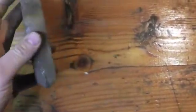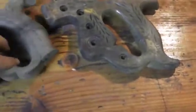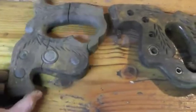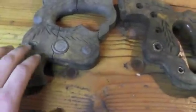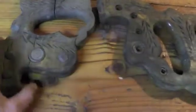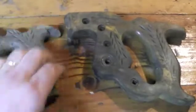The earlier editions of handles used to have a slit that ran all the way through for fitting the blade in. And just to give a little bit of comparison, this is a handle from an earlier generation of the same series of saws. And you'll notice a few things. This one, the newer ones, had more split nuts on them to begin with. Also, the configuration for how they're laid out, the overall length on the saw blade itself. You'll notice that the way the handle's cut is actually different as well, and this was to allow for different types of grips when you're sawing. The horns themselves tend to be a little bit more long.